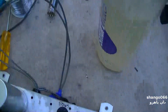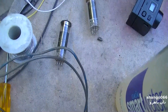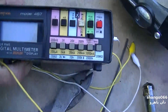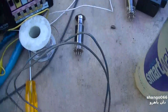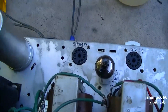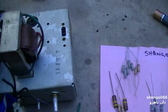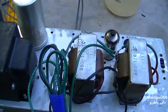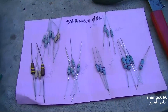What I've done is I've pulled the two vacuum bulbs out — the power bulbs — and we'll try this meter. We're trying a different meter in every video here. This one is nicely made in the USA; it needs to be calibrated, it's a little bit off, but at least it'll give us an idea. I'm going to go through and start changing the resistors — I'm just going to cut them and J-hook them in there, not desolder them, so we'll get accurate measurements as to what they actually are. We'll be back after a few minutes.